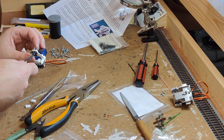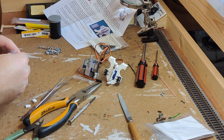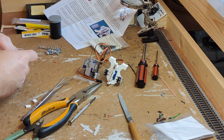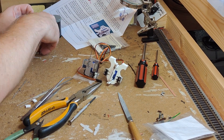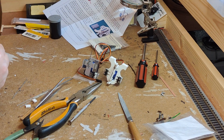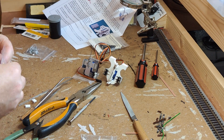I find re-bending easier than cutting the end of the piano wire above the baseboard. Both motors use the same microswitch contact method for frog polarity switching. Although unlike the Dingo servo mount, the MERG design has a pivot in the centre, which means it has the switches on the opposite side. The red wire goes to the switch on the other side of the track to where the red droppers are.